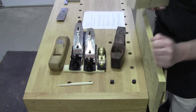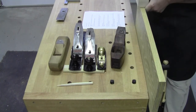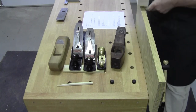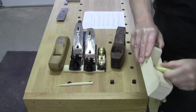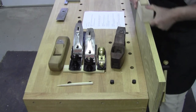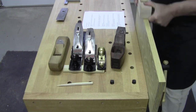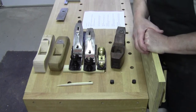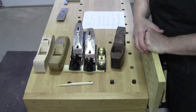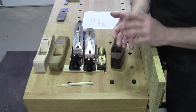These tools are meant to be used. They're not meant to sit on shelves and just look pretty. So guess what? They're going to wear out. You want a wood that works easy, that you have plenty of, and it's not going to cost you an arm and a leg. Want to make your plane out of rosewood? Knock yourself out. Lignum vitae, knock yourself out. It has to be dry, it has to be stable, well seasoned.